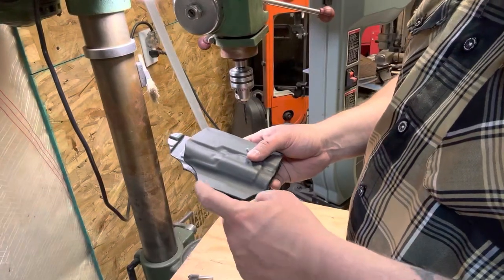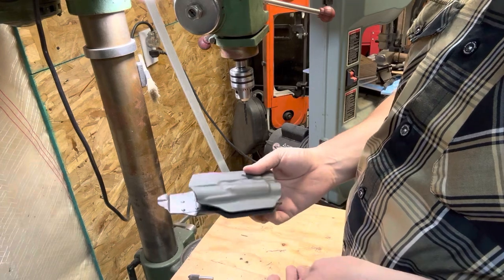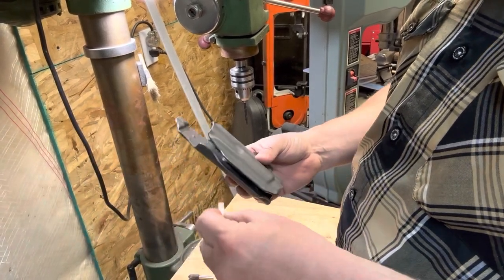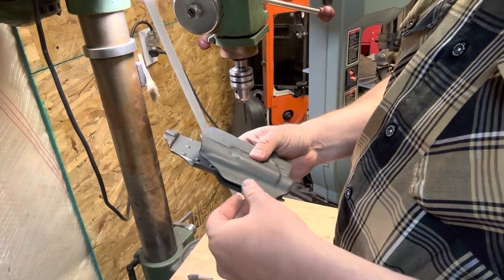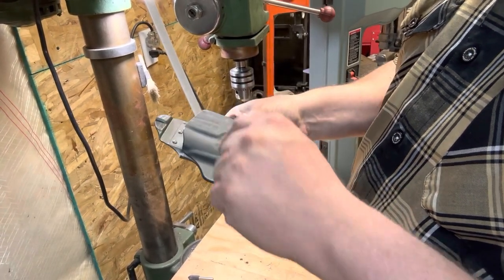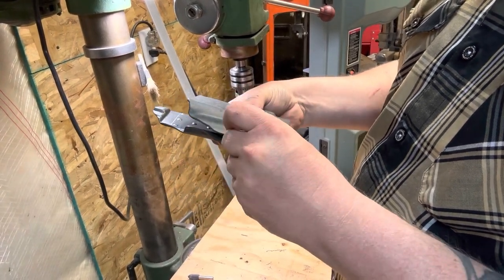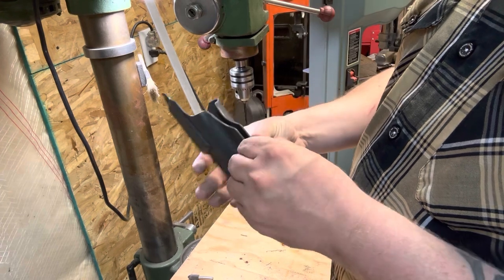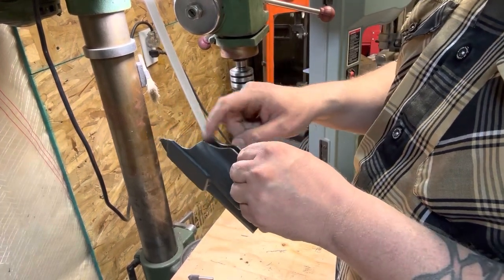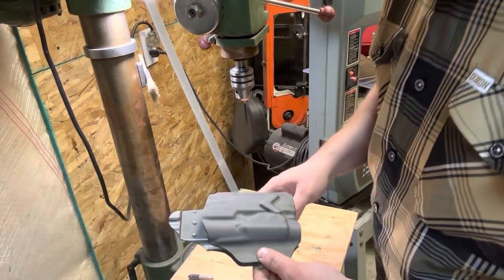We're gonna drill these 2 spots and these 9 spots. And to drill these 2, I'm gonna take a little piece of that plexiglass that we had and just put it right between there. And the only reason I'm doing that is because I don't want a straight hole when it's together. I want a straight hole when it's 1/4 inch apart. Because that's the space that's supposed to be in there. If that makes sense. Just follow along.